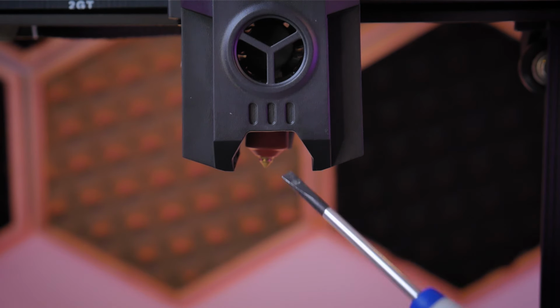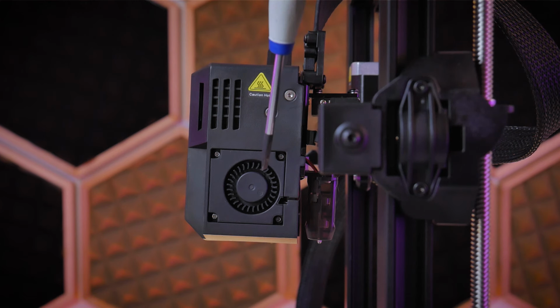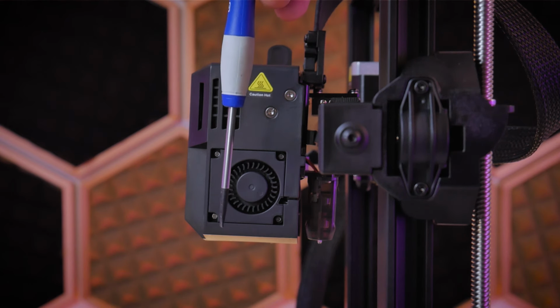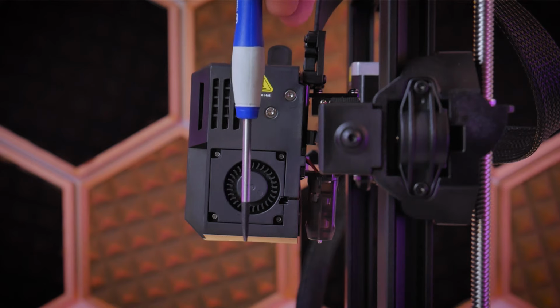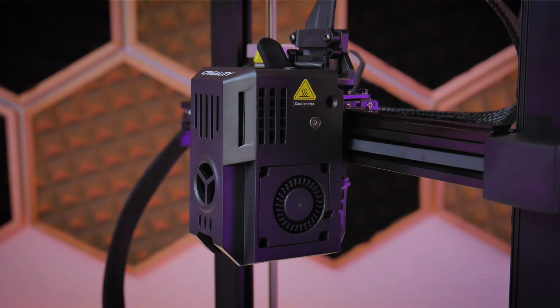And the first thing I notice here is that my nozzle is a little bit bent to the left-hand side, and even the bracket holding the entire print head doesn't look to be bent to 90 degrees. The misaligned hot end should be easy to fix, and we're going to do that. The bracket holding the print head, I'm going to leave as is, and we're going to see how it impacts the printing. I could fix it myself, I have the tools to do it, but for the average person, that's a pretty difficult bracket to bend back.